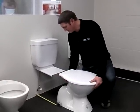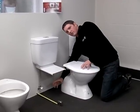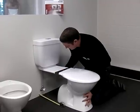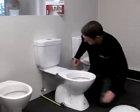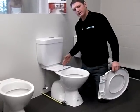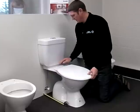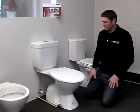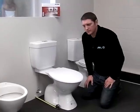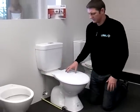The advantage to this means that the pan can in fact be moved backwards and forwards to set where your pipe comes up through the wall, through the floor. And once that's all done and the pan is installed first, let's just pretend, we'll just quickly whip this off. I haven't bolted the seat down. That might be back there like that. What would then typically happen is the plumber would cut that back like that and then push that on, and it would sit, something of that sort of nature. Obviously the seat would be down properly on the pan. And then you have a nice standard looking toilet. That is one of the main advantages to a link suite over the others, is it does give more flexibility, particularly when the waste pipe is going through the floor, to make it suit your situation.